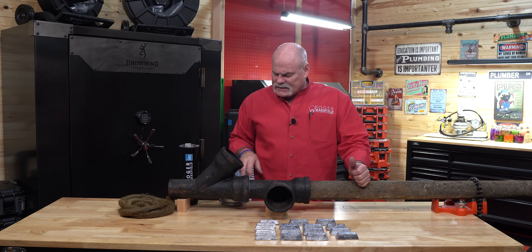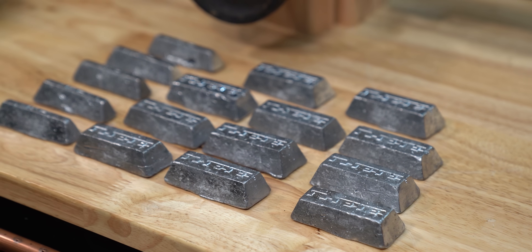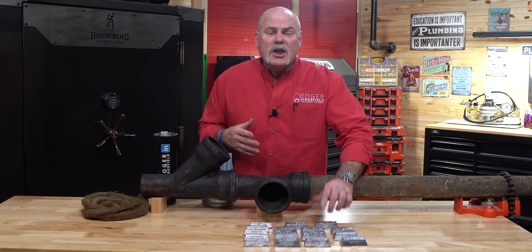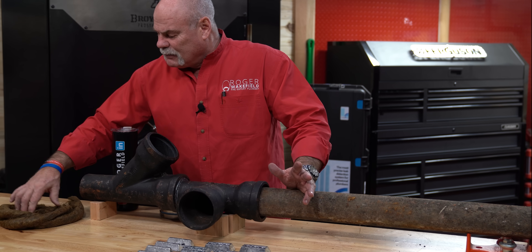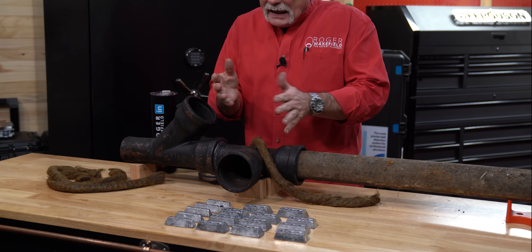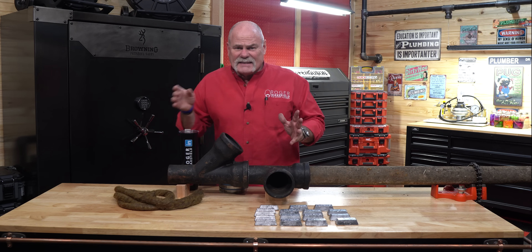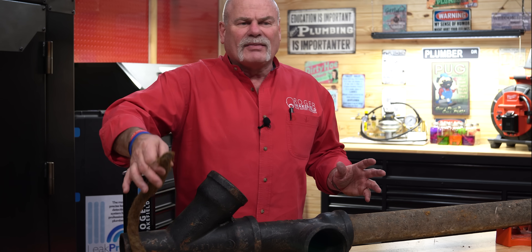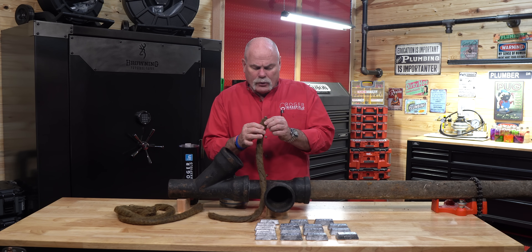We're not going to use a tie-seal gasket or a no-hub band. First of all, as you see, these are not blocks of gold — they're blocks of lead, not worth near as much, but if they were, I'd be on vacation right now. And then you've got your oakum. This stuff always felt nasty — it always feels damp, but this is what actually seals the joint off. It's not the lead. When you pack the oakum in right, it gets wet, swells up, and seals off. It does feel like oiled-down rope.